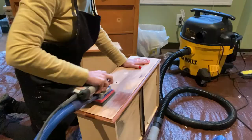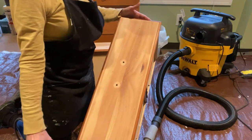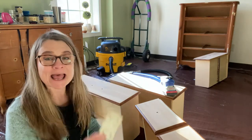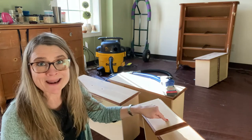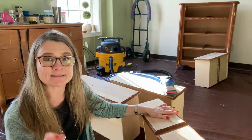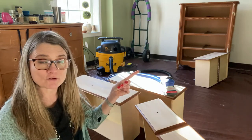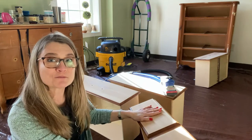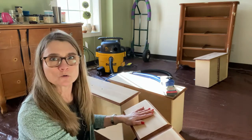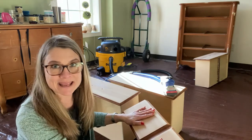Last night I sanded the drawer fronts down to bare wood. I used 80 grit sandpaper on my surf prep, then I used 150 grit sandpaper. Just now on the drawers I used 180 and then I'm going to follow up with 220. I'm also going to sand the base of the dresser with 220. I need to sand the areas where I puttied for dings. Here's my plan: I'm going to be painting the base of the dresser a dark color, and for the drawer fronts, I want to stain it with paint — I've never done that before — but ultimately what I'm looking for is an old weathered look, so I'm going to play around with some paints to achieve that with a paint stain.